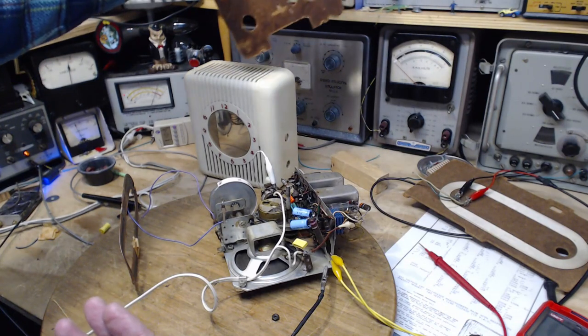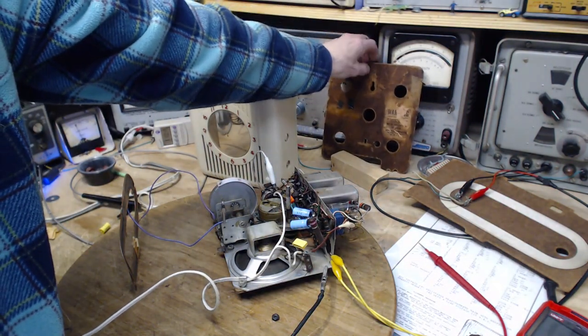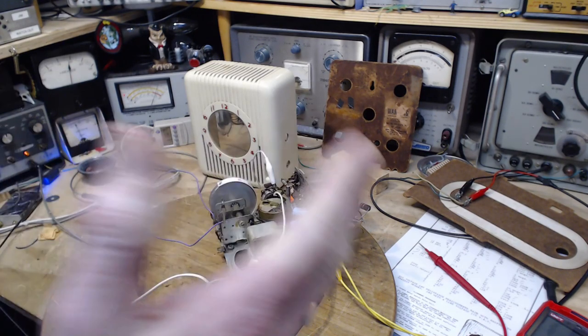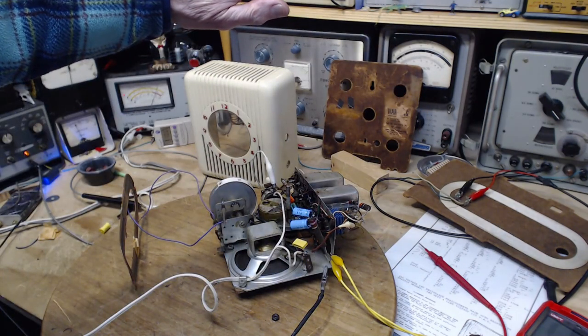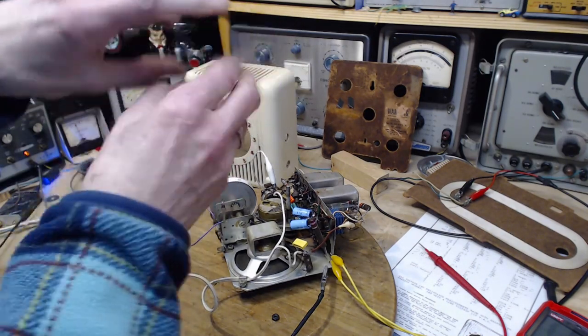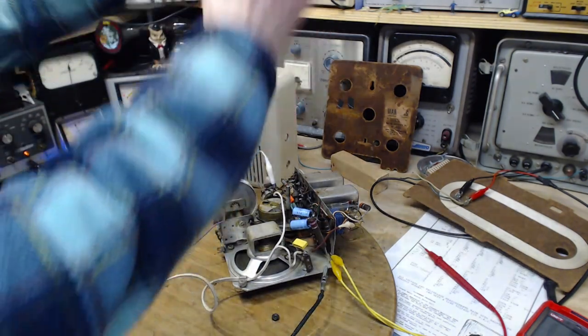So what, you're going to have a cord coming down from high on your wall down to some outlet to power this? No, houses, including the one I live in, have special clock outlets. This house was built in the late 60s, so they were still putting clock outlets in kitchens. My kitchen has a clock outlet. I have a battery-operated clock hanging over it, but if you remove the clock, there's a recessed outlet. The recess was to make room for the plug to go in and for some cord, if there was a bit of cord involved. You could pack that into this recess and then hang the clock right over top.